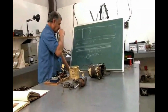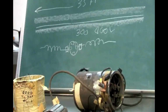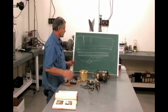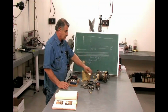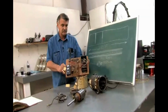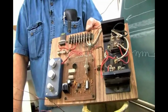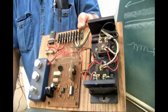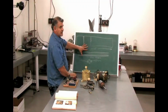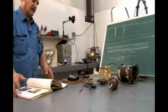So we know all this. The thing is that there was no solid state circuitry shortly after World War II. We had vacuum tubes, but we really didn't have any transistor circuits. So the mistake that was made here is not that the coils were wound wrong, or the case was done wrong, or the armature's wrong. It's this. They tried to make it a solid state switcher. Well, they did successfully get the motor to switch, but this is not the correct way to do it when it was a totally mechanical device using the 4 brushes to do the switching.